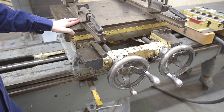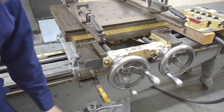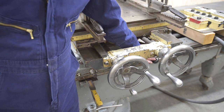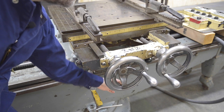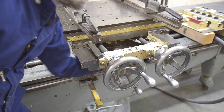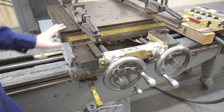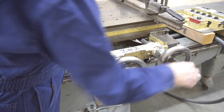Let's look closer at this very important area of the machine. This is the lever to select the gear for whether you drive the table to the left or to the right — currently in neutral. There's also a lock and a detent stop for the rotation of this table. You can move the table manually using this handwheel, but you have to lock it otherwise the handle will just spin and the table will stay put. On top here, above the rotation part, we've got an XY set of tables — it moves back and forth, left and right — with some scales with zero marks.